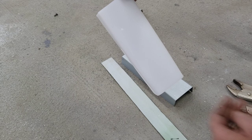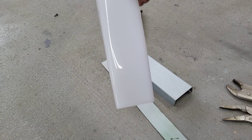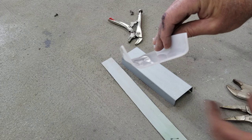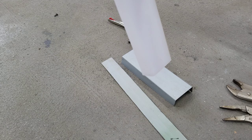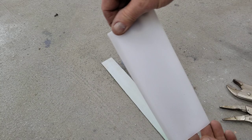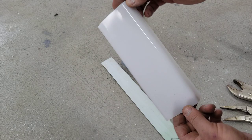Doesn't that look cool? Just drill your hole here for your switch, put your two little holes down here for your screws, put it up on the wall of the bus, and you've got your interior light. This is 50% tint, eighth-inch thickness. You can get it on Amazon — I get it in 12 by 12 sheets for about 10 bucks, versus I don't know, probably 60 bucks or something on the Samba. A little nicer maybe, but who cares — you've got it now. Please like, share, and subscribe.